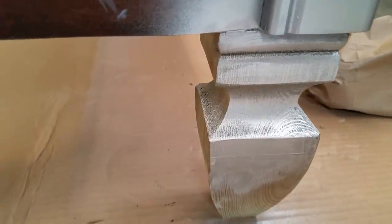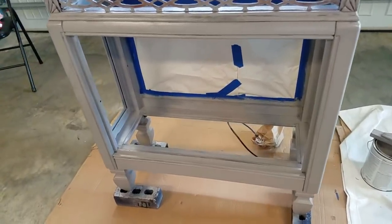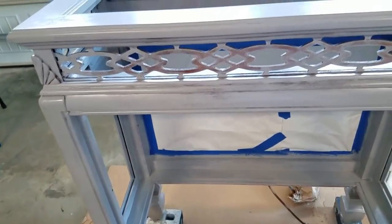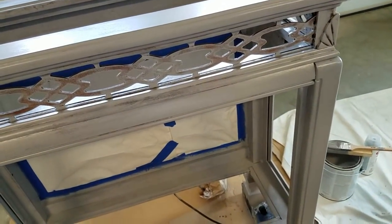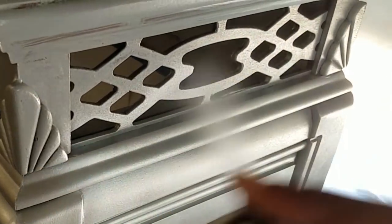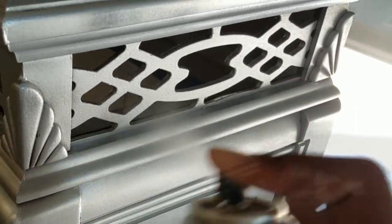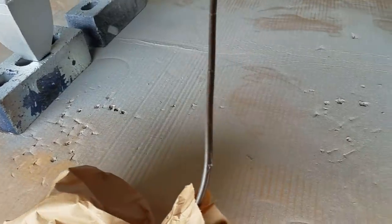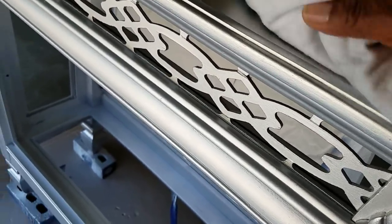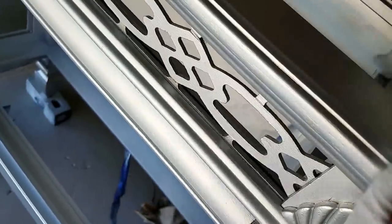I decided to do a little test spray painting and realized I definitely needed to do a base coat. I had some gray paint in the garage and decided to paint the entire thing with that gray paint and then apply the spray paint. That looks so good — the spray paint is going on really creamy and smooth. If this were a simple lamp table, I probably would not consider a base coat. All of this is silver dust from the spray painting. Make it a best practice to buff your pieces after spray painting, especially these metallic pieces — they have a lot of pixie dust from all that sparkle, but all spray paint does.